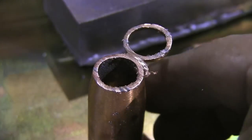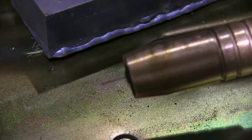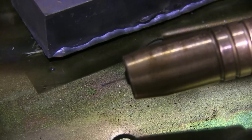It's not optimum for thick stuff. For welding really thick stuff you need as short a stick-out as possible. So I trimmed this one back to where the contact tip is now slightly protruding past the nozzle, and that's going to give me a shorter stick-out and a little bit more punch.